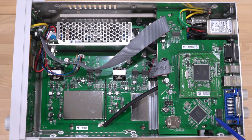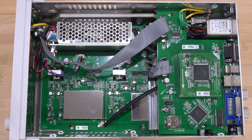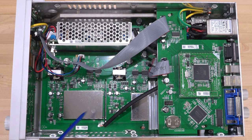There's an Altera MAX 10 handling GPIB functions, routed to the main application processor. Two ribbon cables connect the front display to the back board. There's a mechanical power switch and line filtering on the main board. Before going further, attention to detail is impressive: everything is silicone-downed in place, ribbon cables are protected with zip ties, all screws have anti-slip glue applied to prevent loosening from vibration, ground is connected in multiple places, and shrink tube is used throughout.